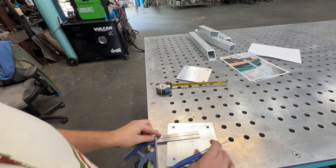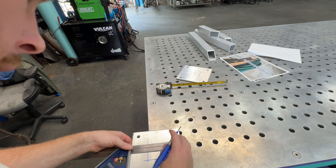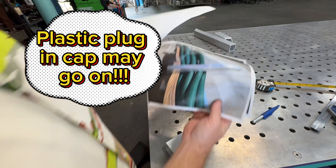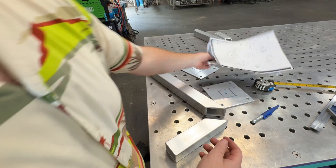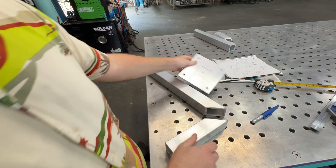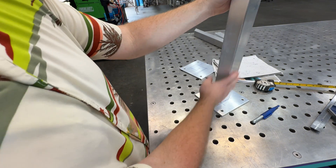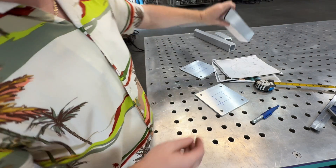I'll just take my square and throw my line. And there you have it. Being that there's not going to be a cap on the top — looks like just a plastic cap goes on top — it'll be fine. But if you had to cap that off, you'd probably be better off drilling a little hole right in here for a vent hole. That way no one sees it — it'll be covered up afterwards. When you're welding, it might create big pressure, so drilling a little vent hole there instead of somewhere else on the tube — that's food for thought.